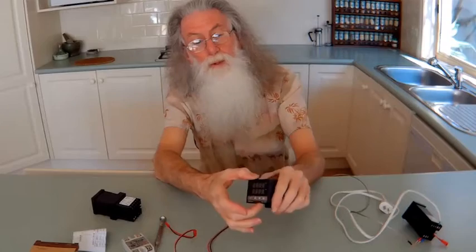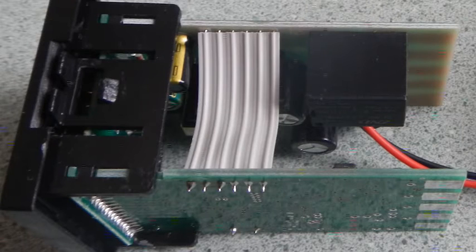Here's the front. On the bottom is that little clip, and you need to push that clip down to push these fingers down — push it flush — then pull off this front cover. When you get it, it will be tight, so just get a small flat blade or screwdriver and go around slowly lifting it, making sure that clip is below there. Then you can pull off the cover — you don't have to unscrew all the terminals. The PC board just slides in and out, separate from the terminals. You'll see the relay as shown in the photos.